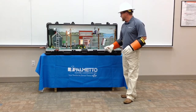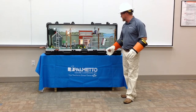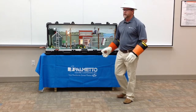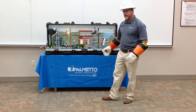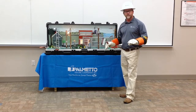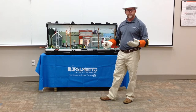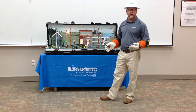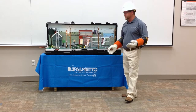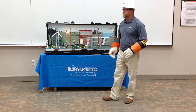So when I talk about the tires on the tractor, whether it's on a tractor or a car, those rubber tires, as long as you're not touching anything metal, I would pretty much assume you would be safe until you got help on the way, and we knew for sure that this power line was not activated anymore, that it was dead, and the fuse had blown, and we felt safe that you could get off the tractor. But unless that tractor or anything caught fire, you need to stay on that tractor.